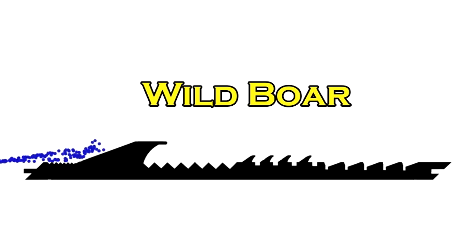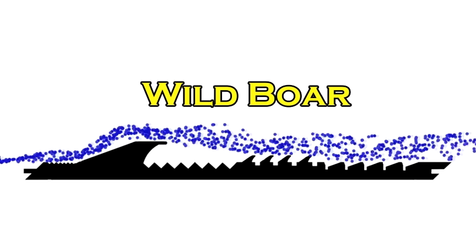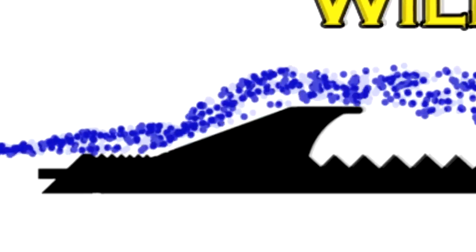So that's also what I want you to think about, and it's sort of the principle, whether you have riffles, expanded metal, use our mats, no matter what type of equipment you're using. I want you to understand that it takes a certain amount of force to get gold moving because it's very heavy, but gold will drop out first because it's so heavy. As soon as you start to reduce the force, it'll drop out, whereas everything else will keep moving. So when you look at our mats, understand that concept.